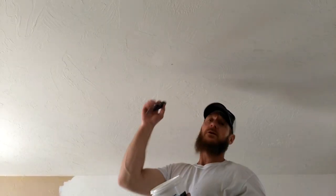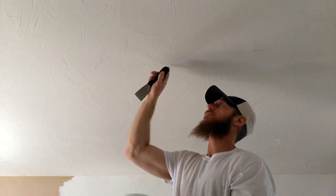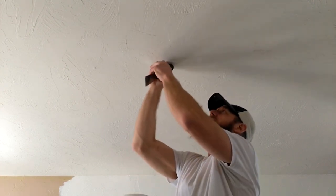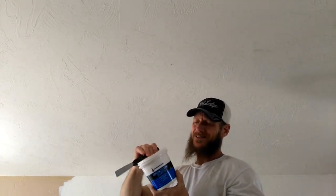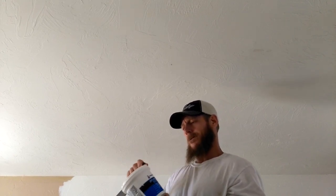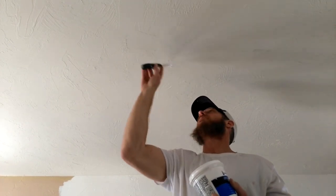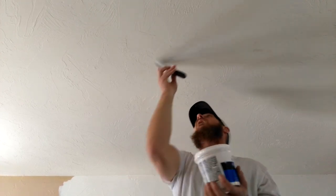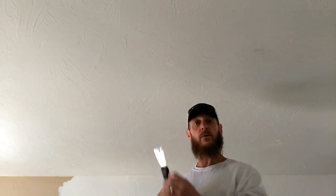Go along your ceiling, make sure there's no tape up there and things of that nature. Then look for your holes. If you're not going to reuse them — some people have flower pots hanging — I take the back end of my putty knife and countersink it in there. Then I'm using some spackling paste from Sherwin-Williams; it has a 30-minute dry time, dries really quick. Fill your hole like such. Go around your whole room, look for holes and any imperfections, get them filled, and we're on to step number three.